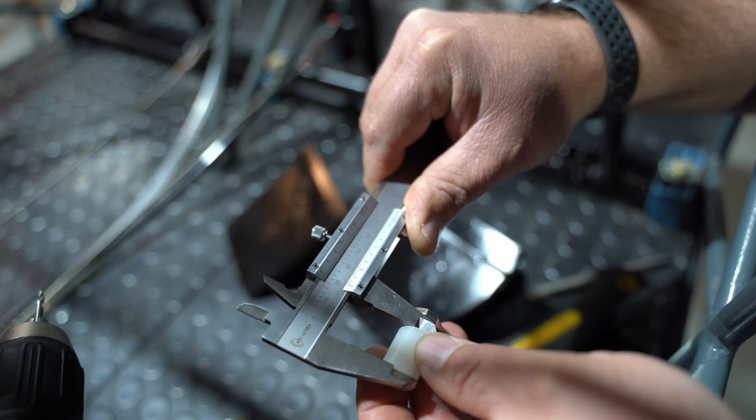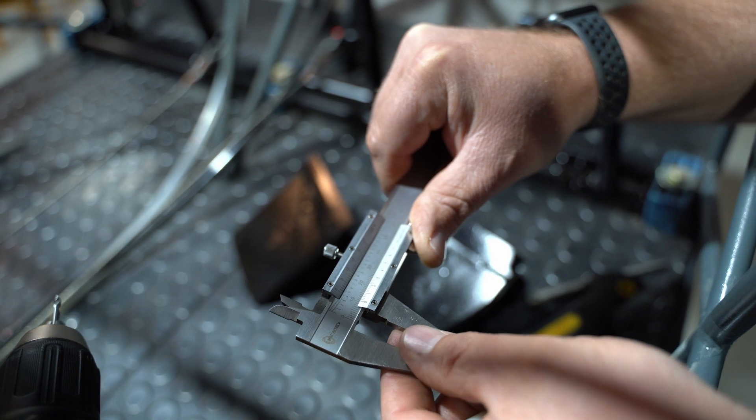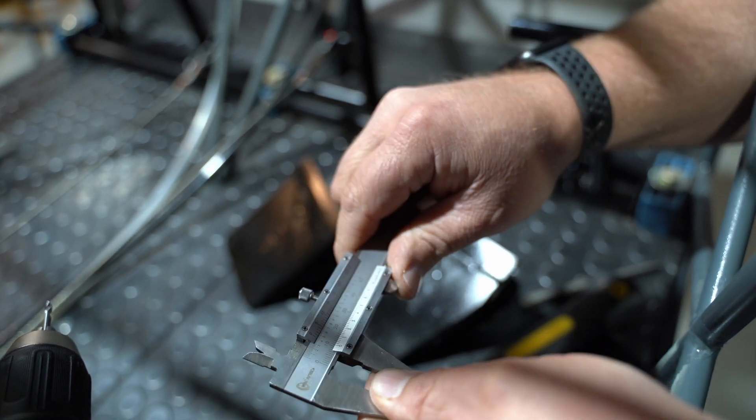You can drill the holes two millimeter or 3.2 millimeter — the size doesn't really matter, but 3.2 is something you'll be using all over the airplane so just drill them 3.2 millimeter. Drill the hole approximately halfway the size of the bush, so about 10 millimeter from the side of the rudder pedal, straight on top.